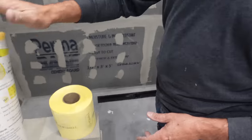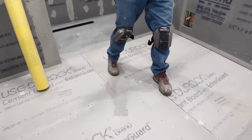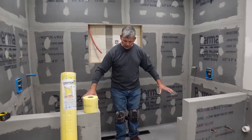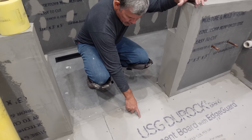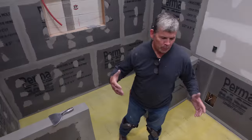Here's the band material — same product — and we'll do that around all our corners. Since we have a whole roll that's 75 feet long, we're just going to do the whole bathroom so it's nice and waterproof. The roll is wide enough to do the whole shower; it'll come out to about right here with a perfect overlap — a full sheet here with no notches — and at the doorway we'll put a full sheet notched around this wall. There we go, all three sheets are pre-cut.